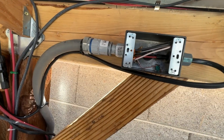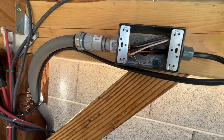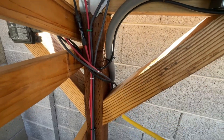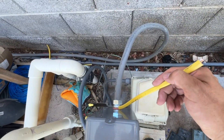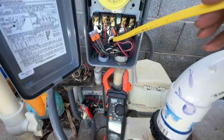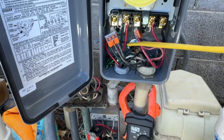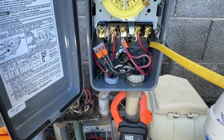Our 240 volts AC comes down these wires, wraps up, and comes into this junction box. We have our black and red wires — the red wire goes into this Wago connector, which has a white wire that continues the circuit. Same with the black wire from the trunk cable — it goes to a Wago with a black wire, and both the black and white wires continue the circuit down this conduit. The conduit goes all the way down to the ground, comes up through the back side of the pool pump timer, and those wires land on screw number two and screw number four.